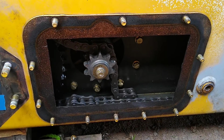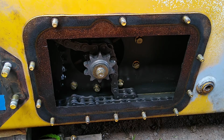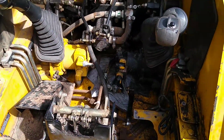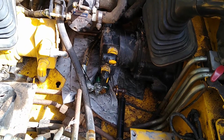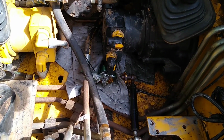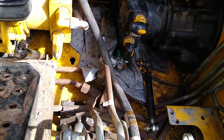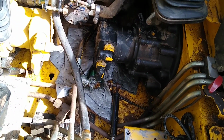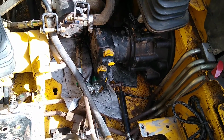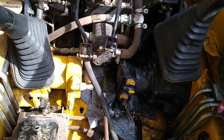Kind of encompasses that area. So we're gonna prop up the drive motor with some wood to hopefully not have 100 pounds of metal come crashing down inside the skid loader. You can see it there. And so we'll put some wood underneath, and then we'll also install some bolts on the side that will hopefully allow us to use it as handles. Unfortunately, I don't have an engine picker, so we'll do our best to try to get it out of there without causing a hernia.